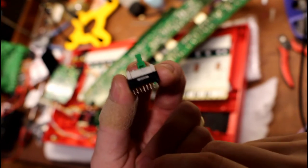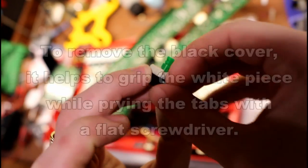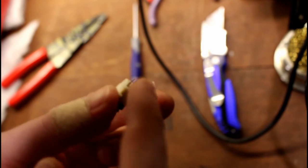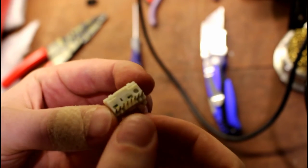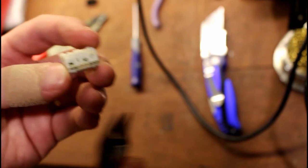To get into it and clean it up, we need to remove first this bottom cover — there are two plastic tabs on either side holding it in place. Make sure that you clean the solder off these pins really well before you try and remove the black housing, because otherwise it won't slide off over the pins. With that off, you've got four places where the plastic is basically just melted down over the bottom piece. We're going to take a pair of flush cutters and just snip those right off.